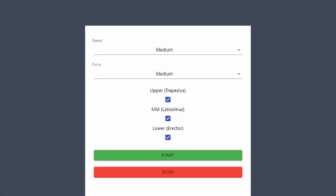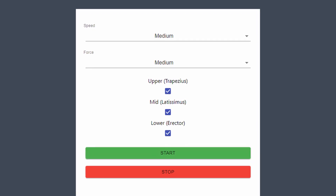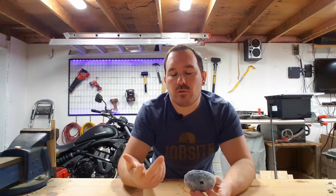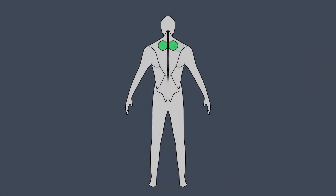There are two major parts to all of this. The first one is just a basic web interface with a couple of drop-downs and buttons, so you can choose which areas of your back you want to do, how fast or how hard you want to press, and to stop and start as well. Everyone has a phone — you can just connect to that with no real extra hardware needed. The second part is just a simple Python script that connects to the UR through the RTDE interface and streams different positions that it wants the arm to go to, and enables and disables force feedback at different times. All the code is written in Python and I'll put it all on GitHub if you want to go look at it.